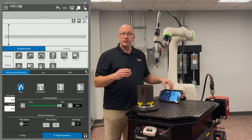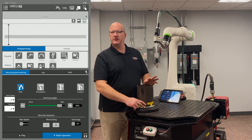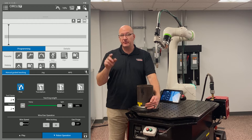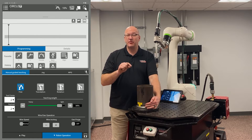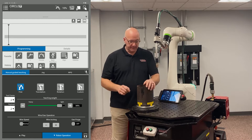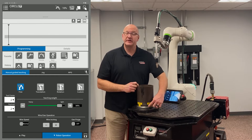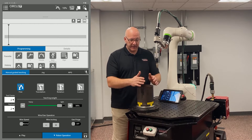You need two circular moves to get around a full circle — each one is an arc, half a circle — and they're called weld point C. With a circular move, it takes the previous point, then we go 90 degrees and put in a weld point C. That records two points but only saves the first one. We then go another 90 degrees — now 180 degrees from start — and touch up the second point of that weld point C. The robot uses all three points to plan the path around the circle.